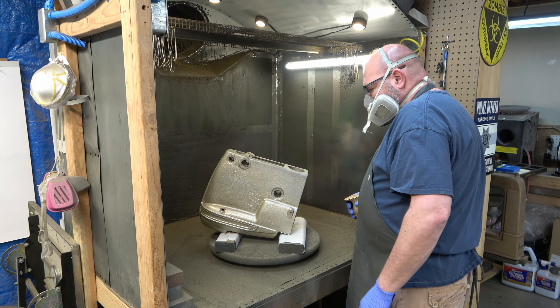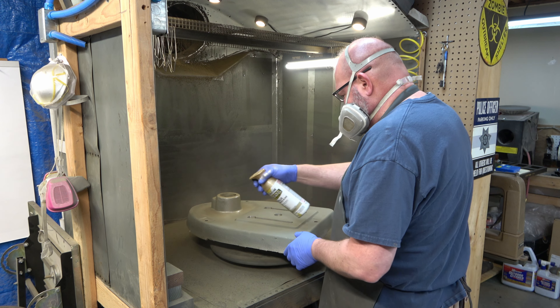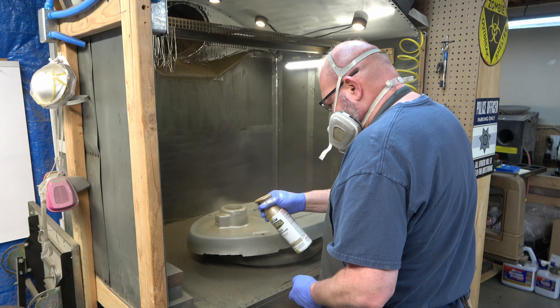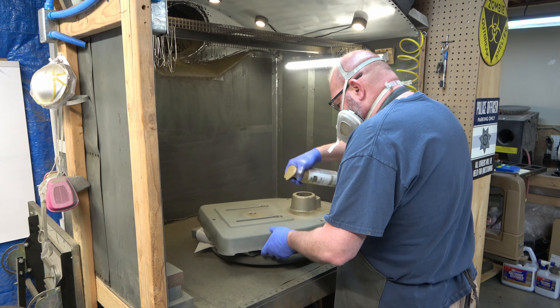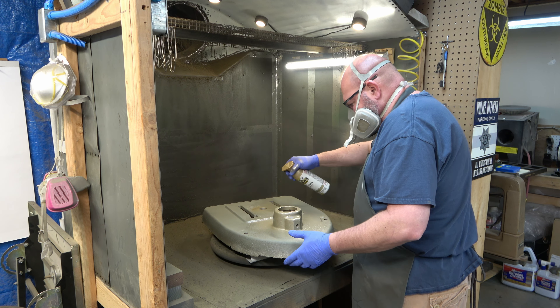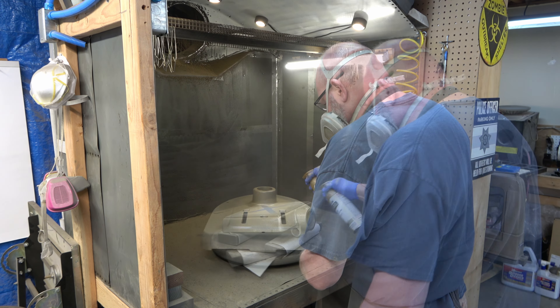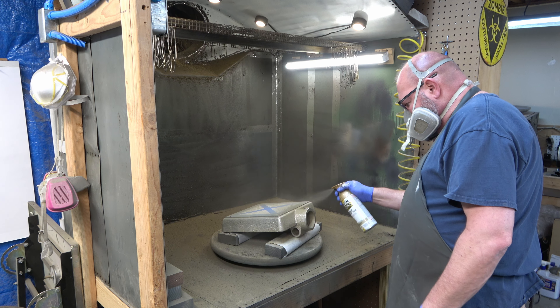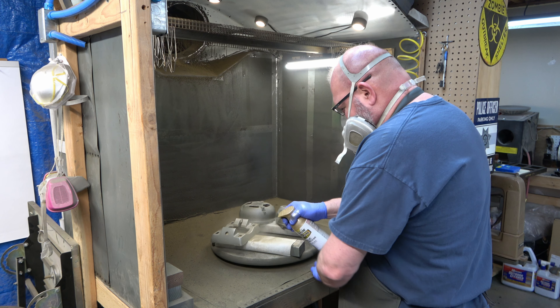I could probably be a lot more accurate with an airbrush, but spray paint is easy and it's inexpensive. And it's what most of you guys would be doing if you were going to repaint a drill press anyway. I used about three, three and a half cans of this Champagne Mist on this drill press. I couldn't find it locally anywhere here in Georgia, so I had to order it online and had to order a six pack of it. And this is the table — I'm painting this side of the table first because I can lay the table upside down on the masked off area for the surface and don't have to worry about marring it up.